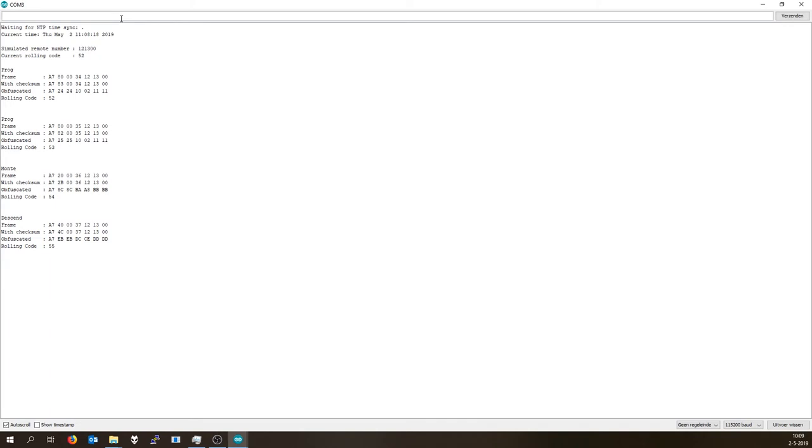Also, the configuration.yaml file for Home Assistant is in the description. You just need to pick and place that into the configuration.yaml. You might want to adjust the MQTT topics, but that's not necessary, I think. And then you've got your cover controls with little arrows and a stop button, which of course are up, down and stop. The sunscreen remote is also supported on the ESP. So basically that's it.